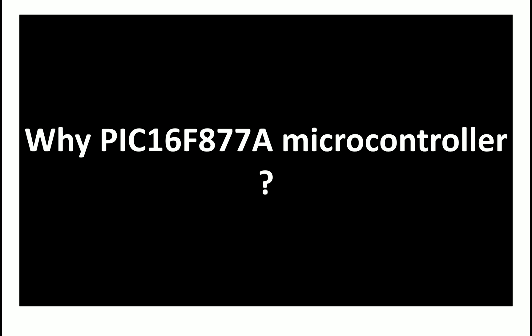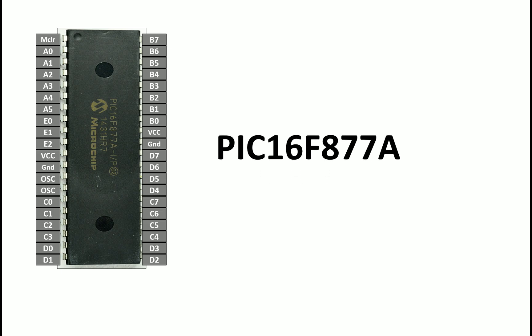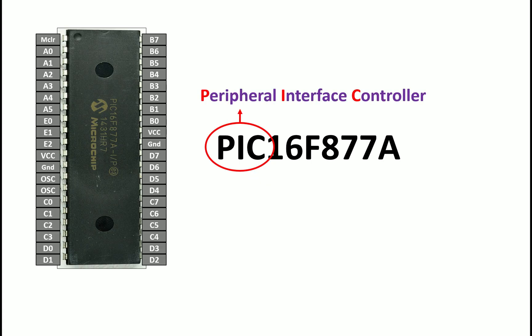The first thing is I want to cover all the microcontrollers, and the first one is the PIC. This over here is our PIC16F877A microcontroller having 40 pins. It's a DIP version, and it is also available in the SMD version as well. Now, the name PIC stands for Peripheral Interface Controller. In a computer, peripherals mean the keyboard, mouse, speaker, etc. Similarly, with this microcontroller, you can interface a keypad, a camera, or anything using the ports available — and all important ports are available on this microcontroller.